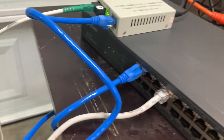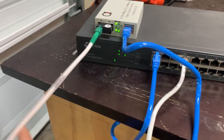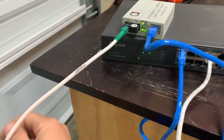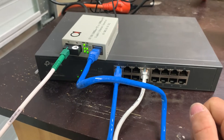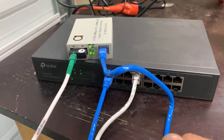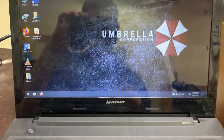These little media converters are great — if you've got long enough single-mode fiber, it's pretty cheap and you only have to run one fiber to get transmit and receive. Put a little switch in another network closet. Instead of running ethernet between network closets, you just run one fiber. This stuff comes pre-made with pre-made ends. These things will come in handy if you've got a big space, a shed, or a house you're trying to run internet to. Just bury the fiber and you don't have to worry about electricity. Anyways, I've rambled on long enough — we're getting gigabit speeds, so go ahead and like and subscribe. Thanks for watching.